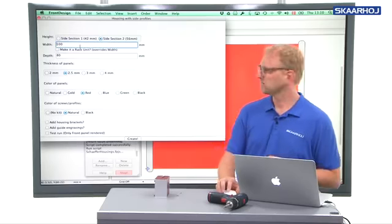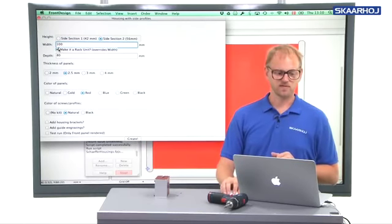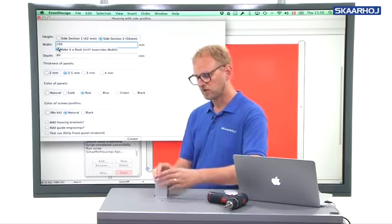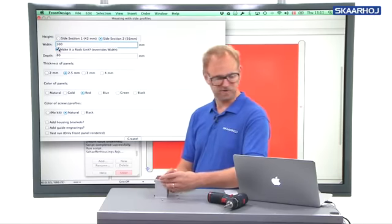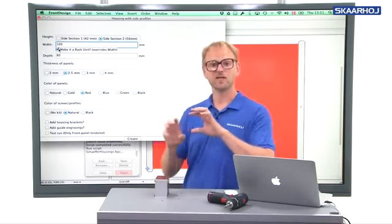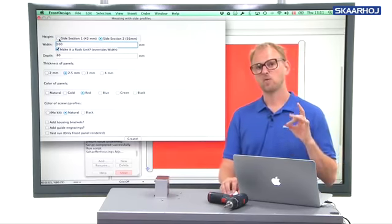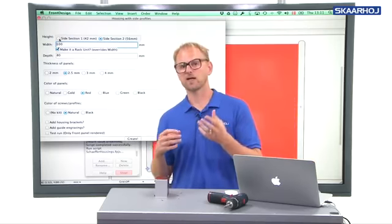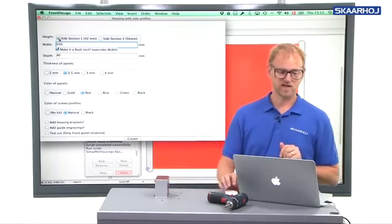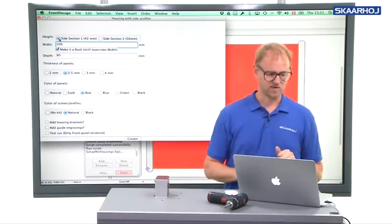And the main point is that we click the checkbox, make it a rack unit. And what that means is really that it's overriding the width of the box. So the width that is currently 100 millimeters will now be fixed by the application to fit into a 19-inch rack. And also we'll select side section number 1, because rack units are something like 44.5 millimeters high at most. So if I select that type of side section, I should get a proper 1-unit rack enclosure.